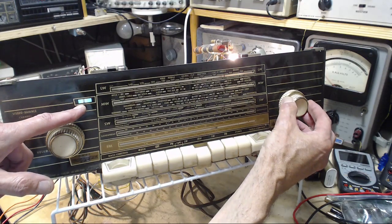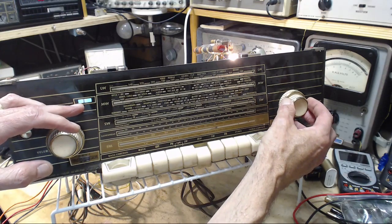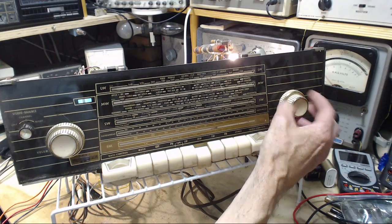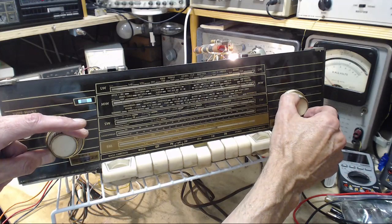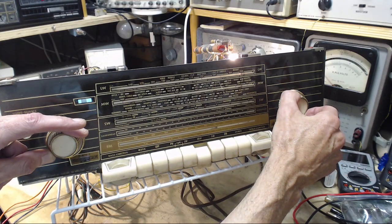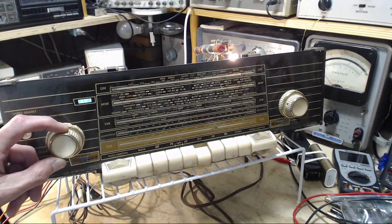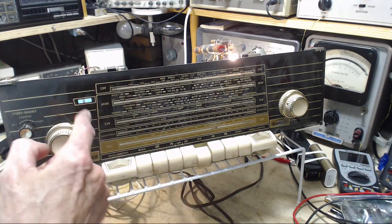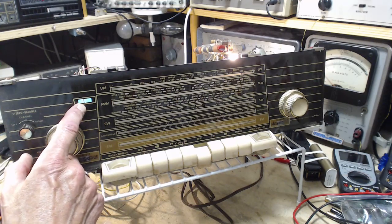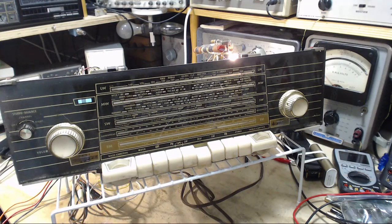Now, this is just interference in my shop. Very powerful carrier, not very much modulation. There's another one. This is fantastic. And we're probably just going to get noise from here. Maybe down here. So that sound, I believe, is the computer in the other end of my house, in my office. I left it on sleep, and I know when it's on sleep, it issues a very powerful interference, just like this. Apparently, this is the power supply supplying voltage to one of the memories to hold the memory up while the computer's in sleep mode. Something like that's going on. But this is really powerful.